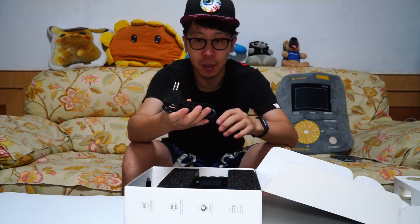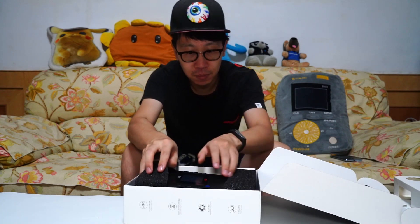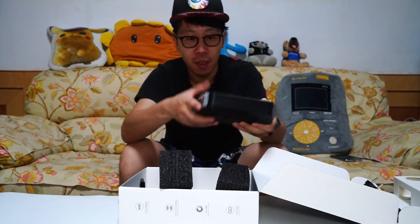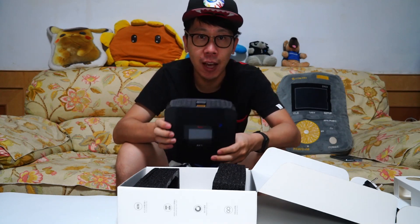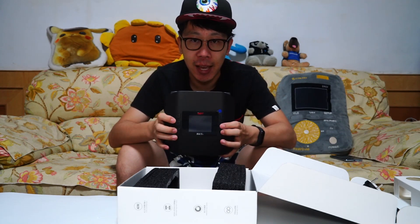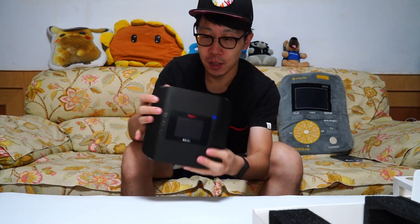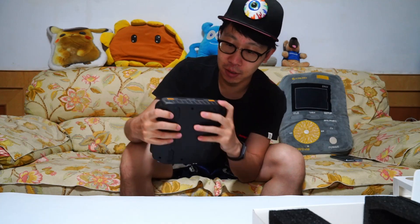Now this is the charger. By the way, this is for Europe. Now this is for the AC. Here is the KEY4 — it's so big because this is an AC and DC charger. I think this has the most powerful AC wattage. It has 400W for AC and 1200W for DC. This is XT90 plugs for the DC power. And here you can see the output — it has two XT60 plugs and supports up to two 8S batteries.